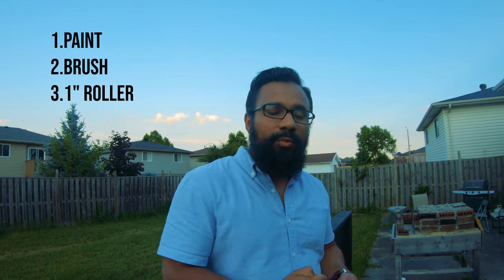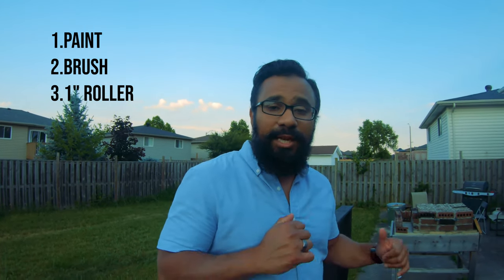At the end I love the project. It's not rocket science, it just takes some time and some work. Make sure you do it with family and get some help. You need a paint bucket, a brush, and a one-inch roller — that's super important. And of course the pressure washer — even if you have to invest in one or rent it, make sure you don't skip it. If you want to take it to the next level, sand the whole thing down for a smooth finish. I wanted a rustic look so I didn't sand. Hope you enjoyed the video — subscribe, follow, share, and hope to see you next time. This is Malik Bhai. Assalamu Alaikum.